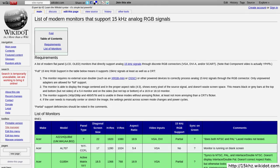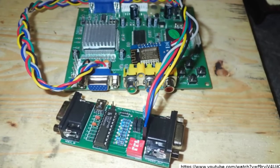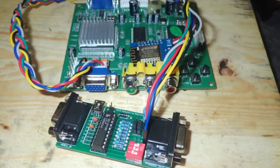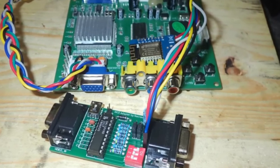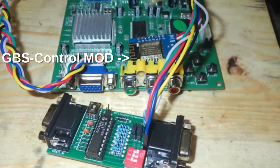So the common alternative is to connect these adapters to an RGBS upscaler, and connect the output of the upscaler to the VGA monitor. But please note that cheap upscalers, like the GBS 8200, need to be modded to work with non-15kHz EGA modes.